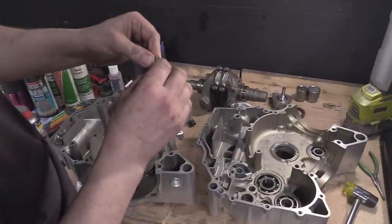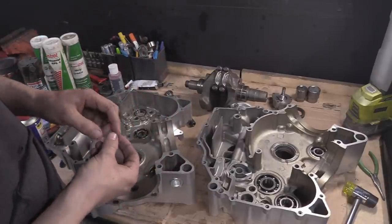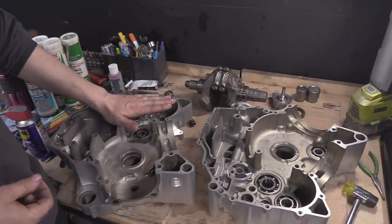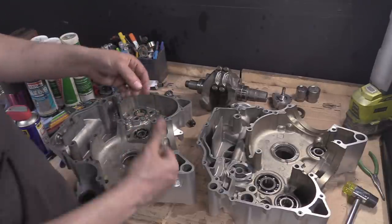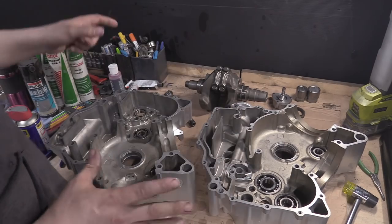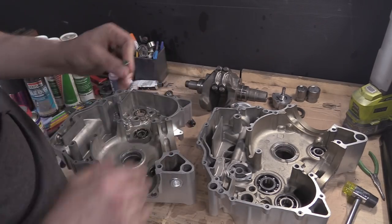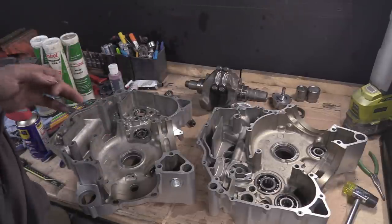But what it's going to do is it's going to make this so thin, and with a thrusting or something of a bearing, it could actually pop off. And a lot of these retainers are to stop the bearings. They haven't got any kind of shoulder, these retainers. These clamps here are literally to stop the bearing thrusting out. And if this head pops off and it just levers out a bit, or something can go wrong, and it's rat, tat, tat, tat, tat, tat, tat, until it wears this down to nothing, you're like, oh, maybe it was just something knocking a bit. The noise has gone away now.